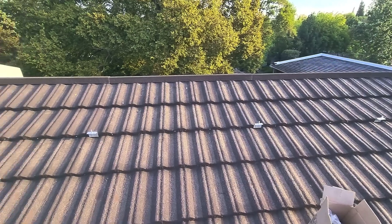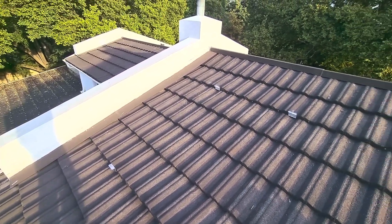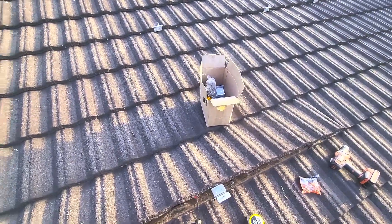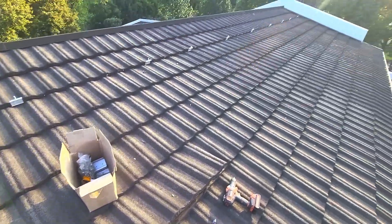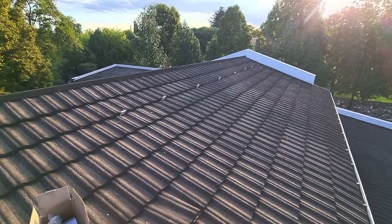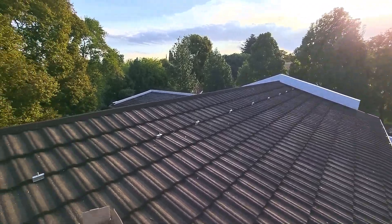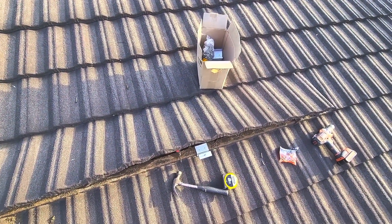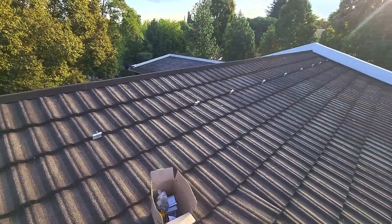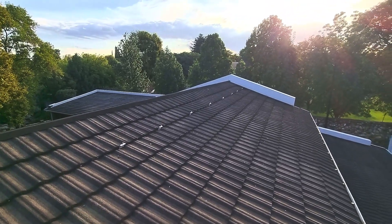This is the correct bracket for Havital, made by Havital. You can buy them directly from the factory in Brakpan — Havital Roofing Systems. If you're going to have solar installed on your Havital roof, please ensure they do it the right way and don't drill holes through it and pop rivet through it. As you can see here, there are no holes being made in the tile — no leaks, perfectly made for the tile. So don't take shortcuts.